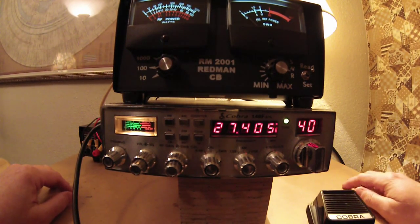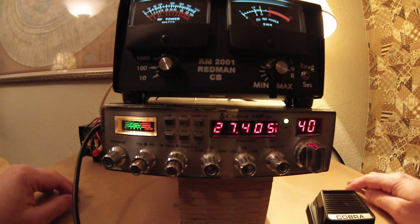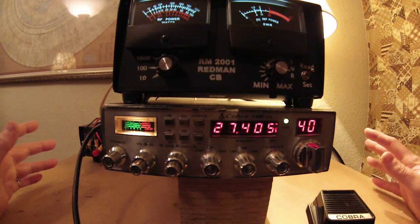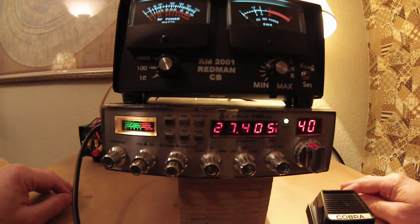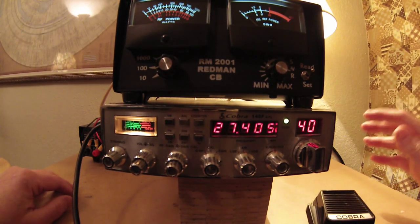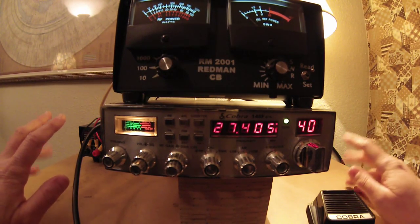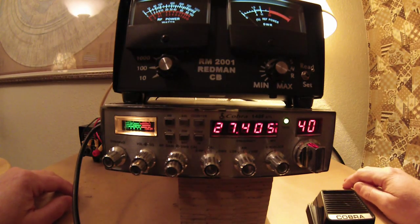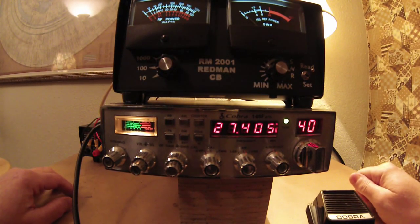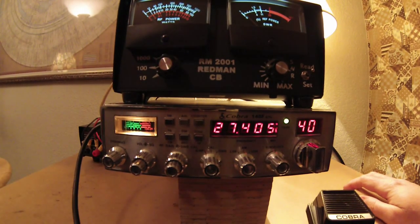This radio is intended completely to be mounted in my truck. I just didn't want to fool with that right now as it's wintertime and I don't want to be outside working on it. I really wanted to experiment with building my own ground plane antenna just for the heck of it, using stuff I had around my house. I got practically no money into the setup I got up there on my roof. The antenna needs to be mounted from the ground up — there needs to be about a 12-foot piece of pipe from the ground going up and then beyond. That is the proper way to do it.